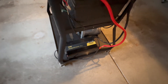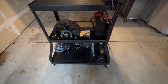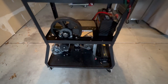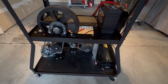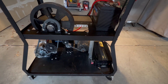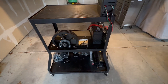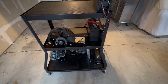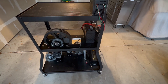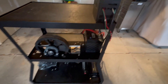They do make a 5000-watt version, so my thought is if I'm pulling 2100 watts, that would roughly give me another 2500 to 3000 watts to play with for running power tools or charging an electric car. That's the ideal situation — a standalone car charging unit. It is pure sine wave so it should work without faulting the car charger out. If not, maybe a home battery.